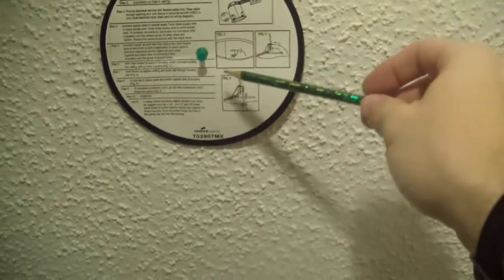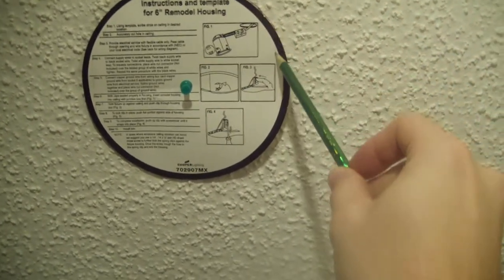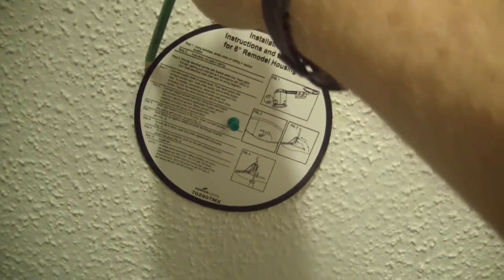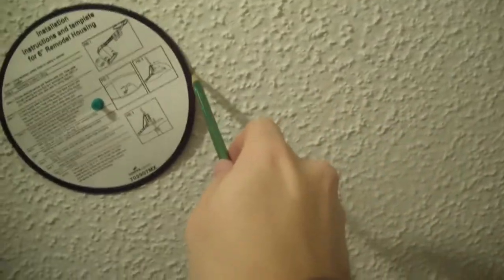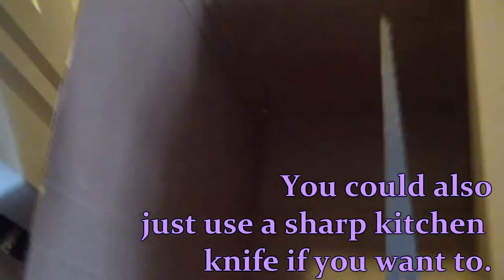Once you've got your spots marked on the ceiling, use the push pin to stick in the center right where you want it on the center line of the room, then trace around it with a pencil. Popcorn is actually really hard to trace over, but the stencil that came with it is a more rigid piece of paper circle. You'll be cutting this out with some trim covering it, so it won't be as bad. When you cut, make sure you cut on the inside of the line — you can always cut off more material but you can't put it back.